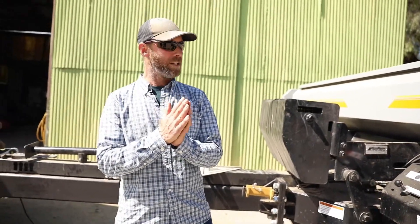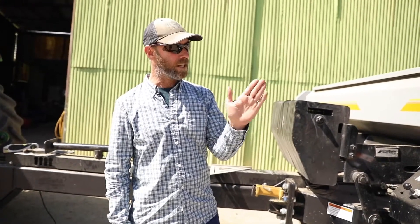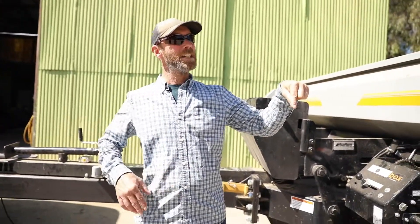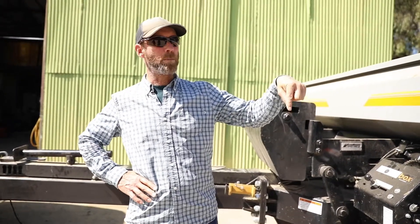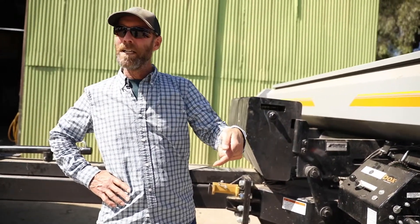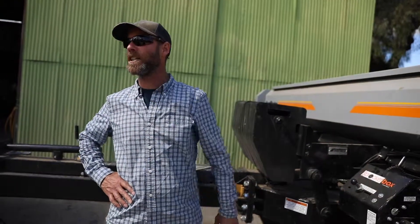The other drill I was talking about has a single coulter in the front making a groove, and then what is called a plow — but it's more like a curved point that makes a little furrow. The problem with that design is it acts like a rake, so when you have residue it just rakes it all up. Whereas the disc slices and rolls over the residue — it doesn't catch anything.